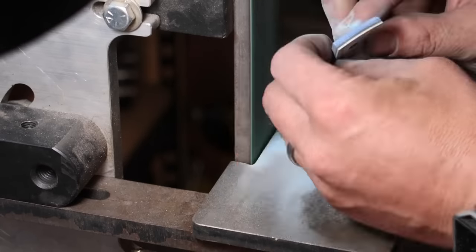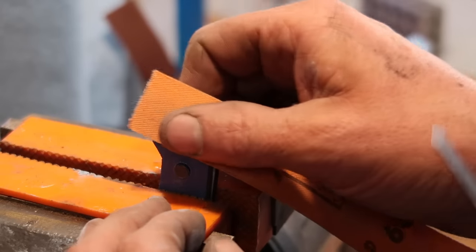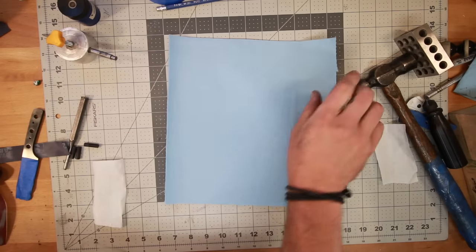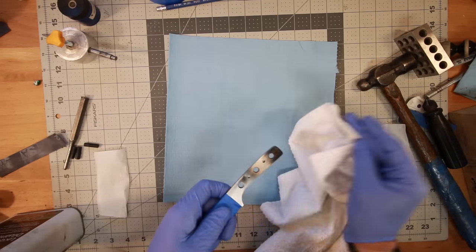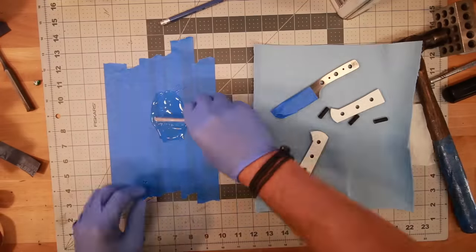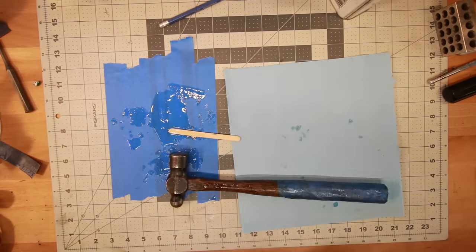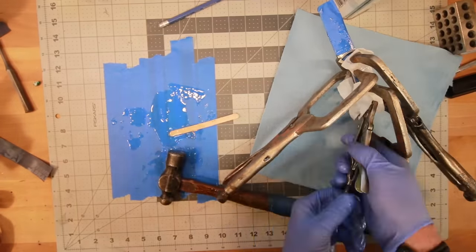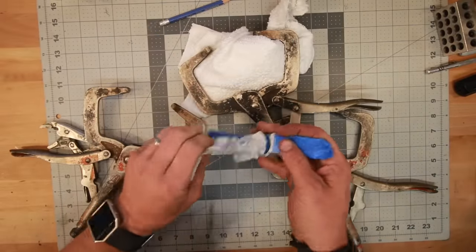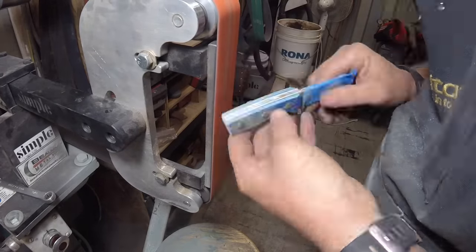I thought it'd be kind of nice because that way you can actually see both liners when you're looking at the blade from the side — none of them are hidden — and it's actually turned out pretty good. Just kind of took this process slow. It's a little bit nerve-wracking, but it kind of turned out. Then we'll just take some sandpaper and clean that up. Get a really nice finish because that part is pretty much unworkable once we have the whole knife glued together. Wipe everything down with lacquer thinner again, and then we will glue the scales on using Devcon 5-minute epoxy. Everything here was 5-minute epoxy because I wanted to get this knife built as fast as I possibly could. Clamp that in there and I let this dry for about 20 minutes — probably I wouldn't recommend that. I don't recommend trying to build a knife as fast as you can either. This was like a mondo rush job, but hey, we've got to get a video out.